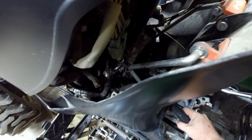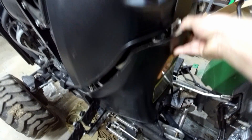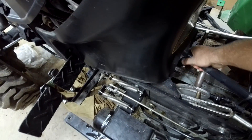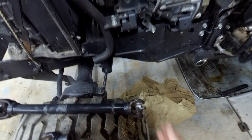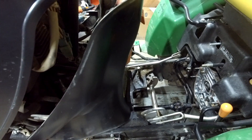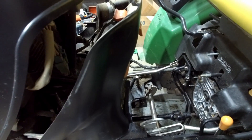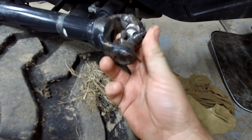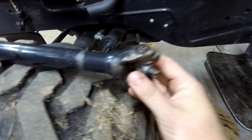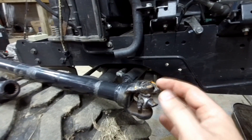I don't know if it's due to these U-joints losing their grease, not being sealed well, or high temperatures — I'm not sure why they need to be greased so frequently, but the problem is they're not very accessible. This one is inside all this cowling, down between those metal plates, right up to the flywheel under what you'd call the bell housing. There's an access cover on this side, but to reach it you still have to remove all your plastic shrouding, and to do that you also need to remove your floor pan. The rear one also has a zerk fitting right in front of the transmission. Normally with the floor pan on and all your pedals and controls, it's not quick and simple. If you don't grease them, these will fail — pretty catastrophically. This tractor only has 200 hours on it, which seems extremely early for it to be dry and have no grease.